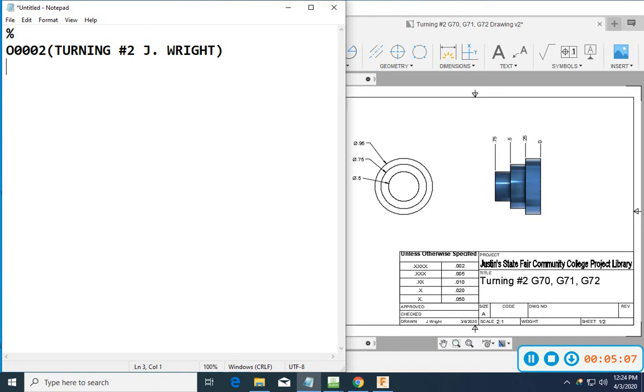Okay, so as of now, I've got my percent sign to start my program out. I've got my capital O, and then I've got my four digits after that, and then my program description in parentheses, so the machine will not read that. Okay, so if you remember from last time, tool 101 means that it is going to be turret position 1